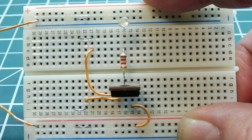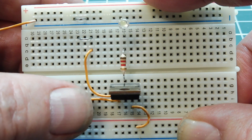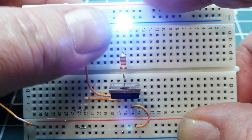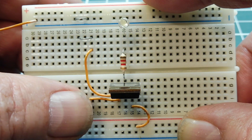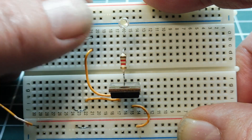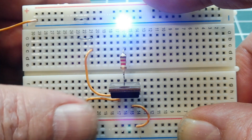If I just gently touch the pads I can actually get a half charge — that would be around the threshold of the MOSFET, so it's not totally on. You can see me actually discharging and charging the capacitor. You can feel the capacitance of the MOSFET, and that gate-to-source capacitance is a dominant feature you have to take into consideration when designing a MOSFET circuit.